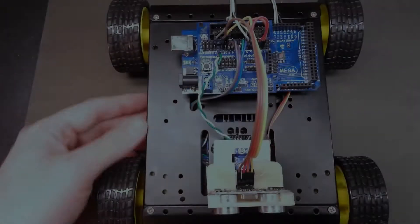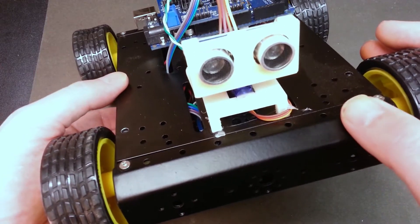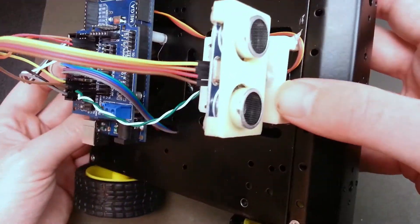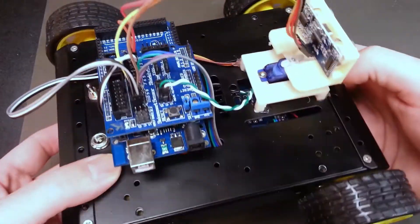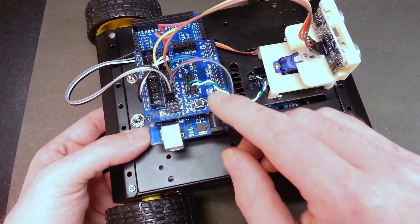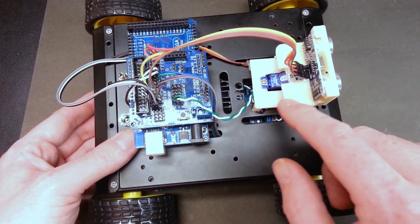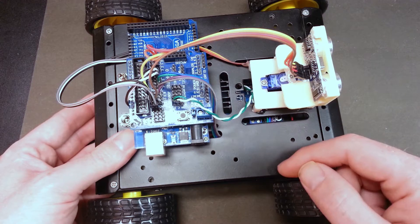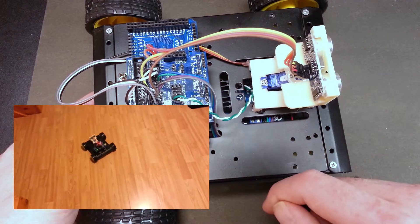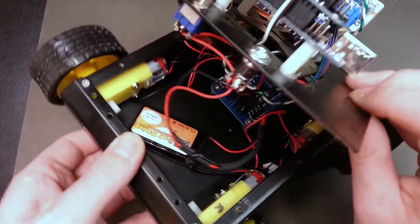So this is the Arduino robot. I've got a proximity sensor on the front and an ultrasonic distance sensor mounted to a servo — mounted with just hot glue since I never thought this project would go this far. It looks left and right and is interfaced with an Arduino Mega with a sensor shield on board. This all comes as part of the SainSmart kit, with the exception of the servo and these printed brackets, which I'll link on my forum and website.